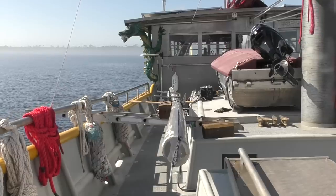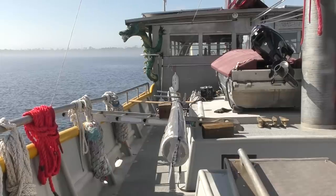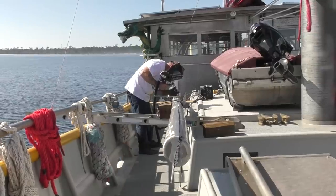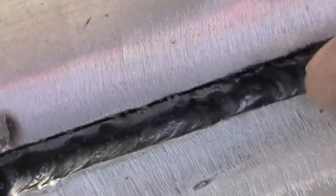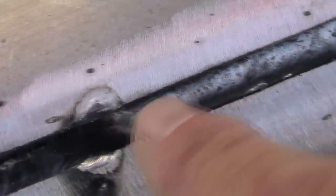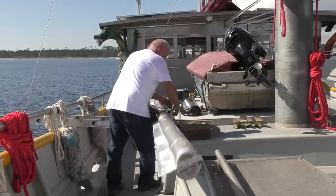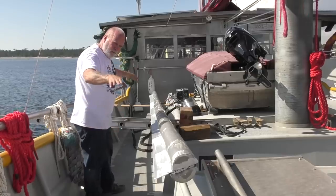It's got a bow in the other direction now. I've got to put a tack in the middle and then bend it back. The trick was just to do it in two steps - the first weld went up against this edge on one side, then I made a second pass on the other side. Now I've got to figure out how to straighten out this sideways turning. I've added a ratchet strap at this end holding the top pipe in proper alignment, same thing at the other end. It goes over the top of the ladder and I'm pulling it down - a little bit more and I can take that sideways bow out of it. It really doesn't have much force on it at all.